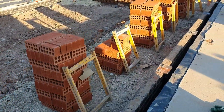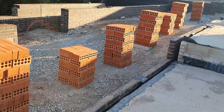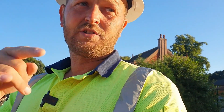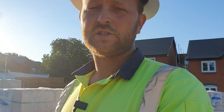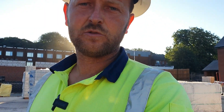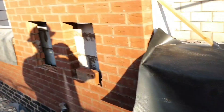The most important job before you start anything is to make sure you've got all your bricks loaded out like this — that's exactly how you want it. Once me and Aussie get a start and I'm laying, he can always drop inside and start loading some of these blocks out. I'll be laying, he'll be spreading — he's already mastered the jointing now so he's picking up new skills all the time. For the sill bricks, this is what we do — flick some damp on, tack it just to your former, and protect your sills from mortar drops that come down.